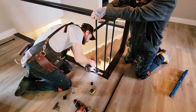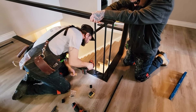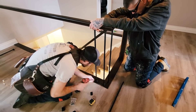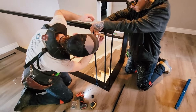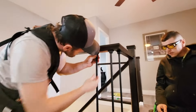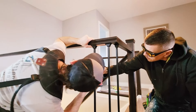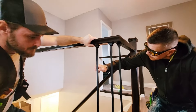Now that those first ones are in, we're going to continue along. You can see this wooden piece being used here — this is our spacer so that we can make sure every spindle or baluster being put in place is going to be the exact same distance apart. It's used at the bottom when we're putting the bottom screws in and then moved up to the top. A lot of times what we suggest is actually taking the piece from the old wooden spindles if you had them. But what you want to take into account is the fact that the feet are wider than the actual metal. So you don't want to be using that same distance you had before — you need to make sure you're measuring the distance between the actual metal and making sure that is the distance you want and that it meets code.